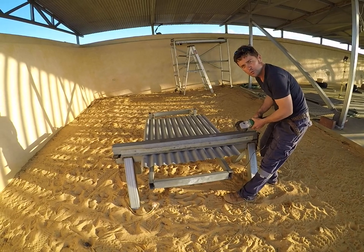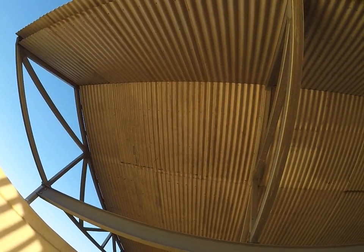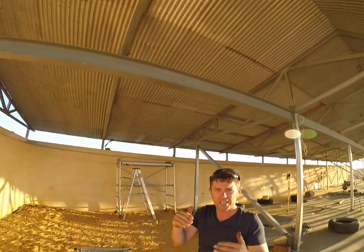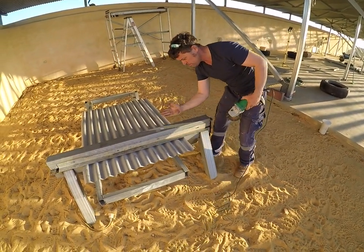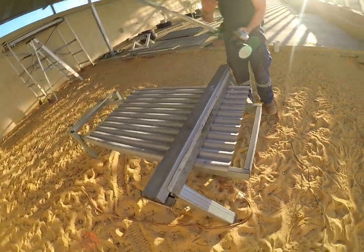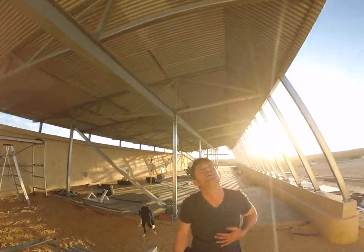When it comes to doing corners — the 120-degree corner up there, you can see it — to get them to join well, we found that if you cut your corrugation at a 45-degree angle, when it comes to fitting it they snug right into each other. We're actually pretty chuffed with those joints up there.